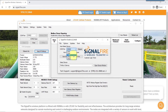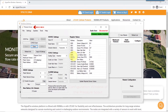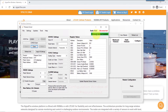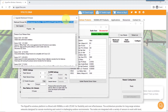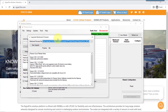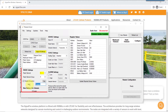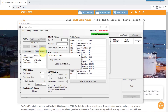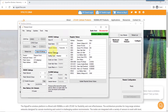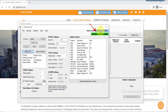Now let's interface with the pressure scout. Select the COM port for your USB 4-pin cable and hit auto detect. If new firmware is available for the pressure scout, you'll see a firmware update button in the top right corner — click it and hit start upgrade to update. Down below you'll see a list of new features based on the firmware. For this demonstration, the existing firmware will be left as is. Match the network and radio network group to the gateway settings set previously, then hit apply all settings and wait a few seconds to maybe 30 seconds to connect. Hit refresh, and once connected you'll see 'connected' and the signal strength in the top right corner.